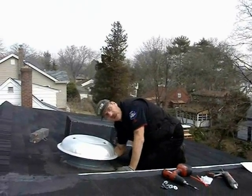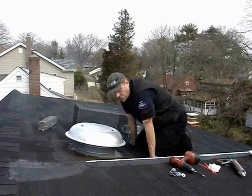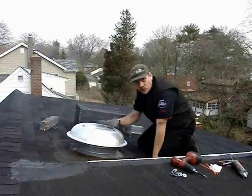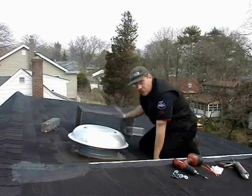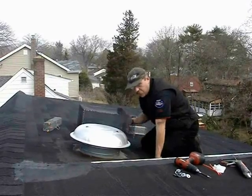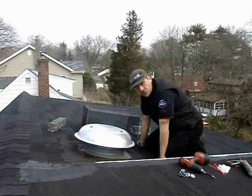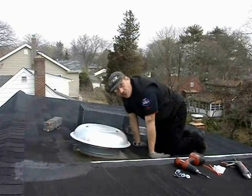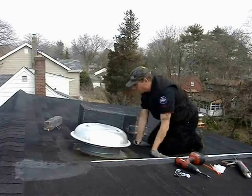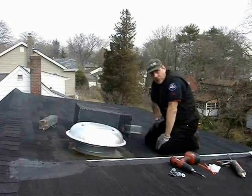We spin it, and it's not hitting anything. Another thing is I always have on our contracts a disclaimer that an electrician should look at this before it's ever turned back on again to make sure it's okay. It's real easy to take our cover off, and then he can put it back on again the same way. This motor here and this one here looks pretty shot — it probably needs to be replaced, but our paperwork will tell them that this may be dangerous.